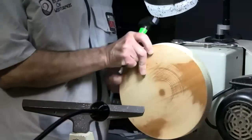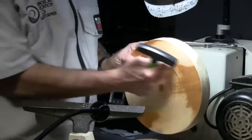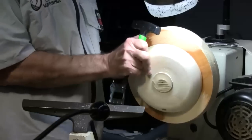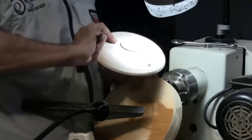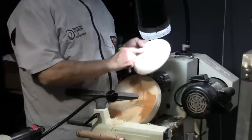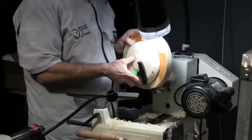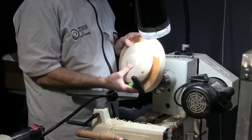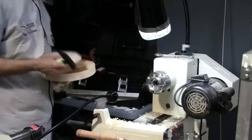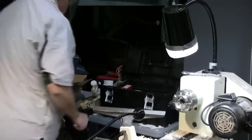I did a recess. You put this on here, but this time instead of making a big tenon, you're going to make a big mortise and wedge this thing in to finish off the top. Maybe put a bead or any embellishment on the top. If you do similar, you do a friction chuck, but this is going to go inside it instead of over. Follow me? You're also going to drill your hole for your knob.